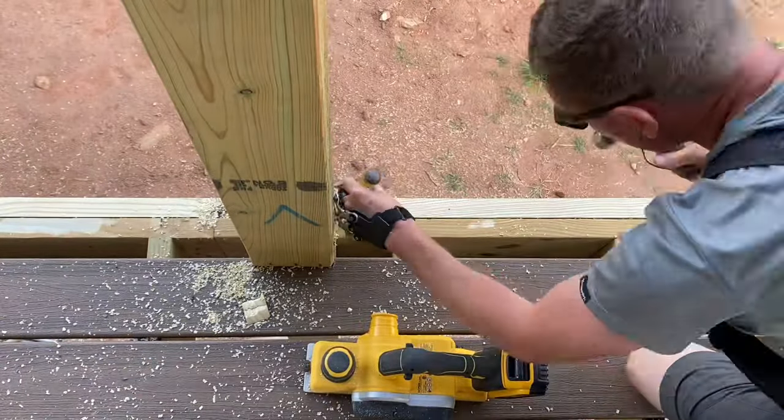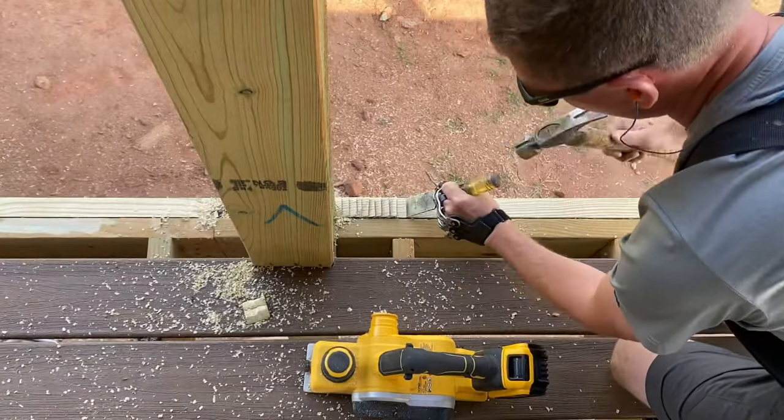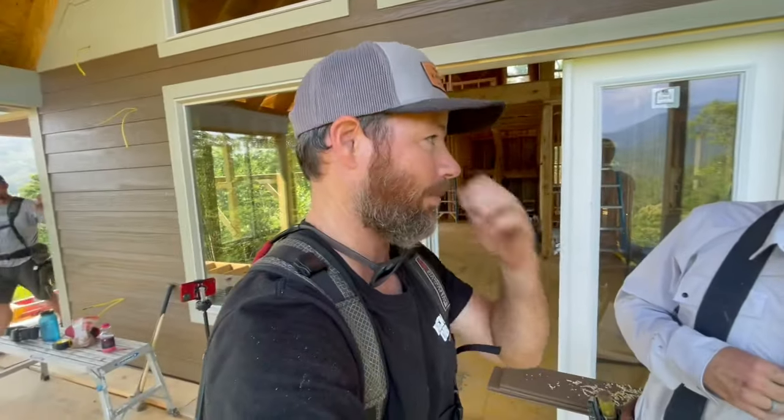That can make it a real struggle to frame something out of pressure-treated material that's all different thicknesses when you need them flush on top for decking. You've got joists or girders that are up to half an inch or more different in thickness and you're trying to flush them on top. The bottoms are all out of alignment, or you flush the bottoms and use a power planer to flush the tops. It's a pretty normal occurrence for us to battle the pressure-treated material a lot more than regular kiln-dried material. It is a process of choosing the lesser of evils. Don't be surprised.